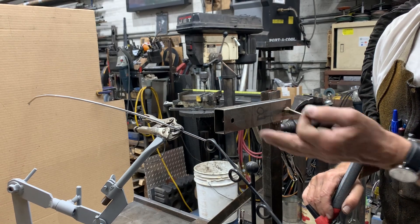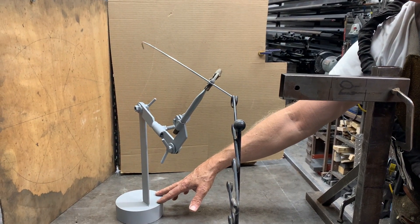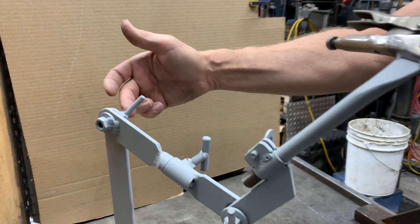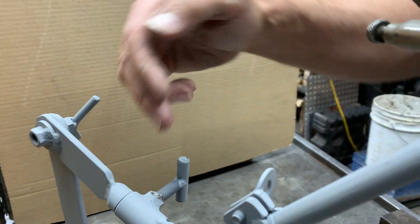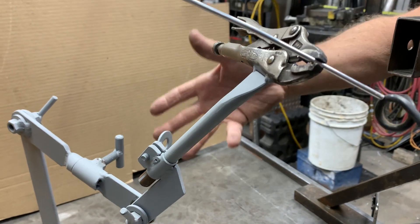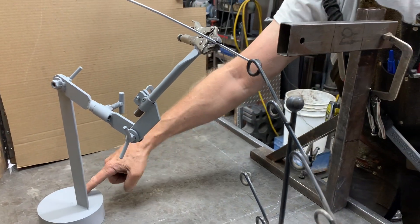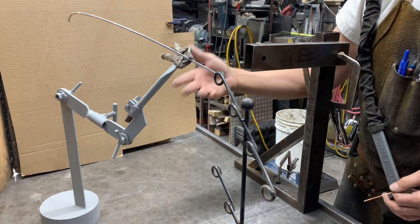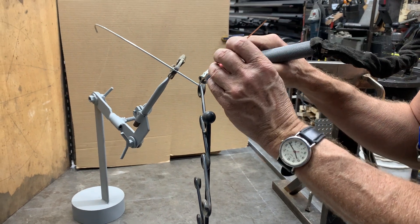It's just very difficult to fixture off of a table. Anyway, this is composed of a heavy base and a little tower section. I have a 3/8-16 bolt going through it with a little handle here. Same thing here for the rotational part, and then again same thing here and here, so that I have a great amount of flexibility. Obviously if you're way, way out you might have to put a clamp on that, but most of the time this is very sufficient — kind of an elegant way to hold a part in a very stable way so that you can make a very precise weld.